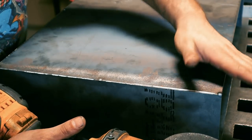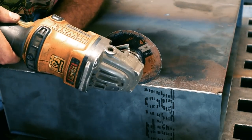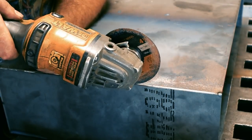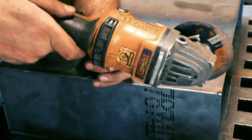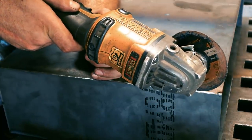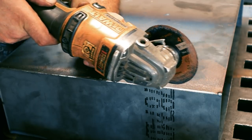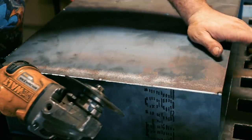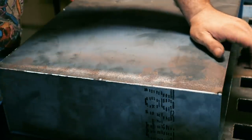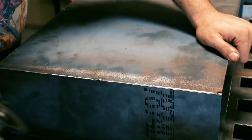The reason I'm doing this, I'm going to remove the welds and grind them. A little trick you can do: a cutoff wheel isn't quite thick enough to make a bevel so you can get adequate penetration. But if you start with that line and then gradually move your grinder to an angle like that, it widens it out. That's a little exaggerated. I've had good luck with this in the past. It's just as easy to bevel your parts first. Like I said, that's probably the recommended way to do it, but that's not what I did.